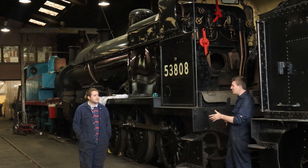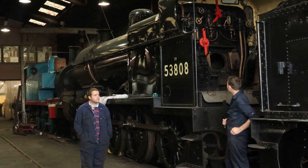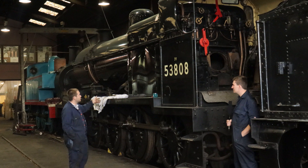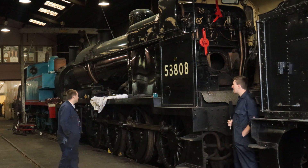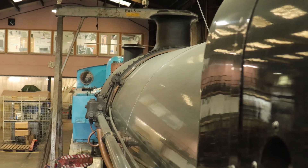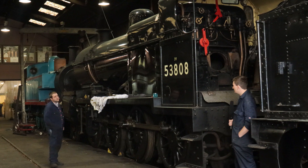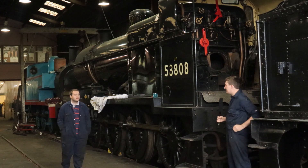In the first episode we looked at Canadian Pacific's boiler which is a Bulleid design. This one is very different — starting at the back and working our way forward, you've got the firebox where the fire bed is, which obviously boils the water as it's surrounded by it. Connected to that is the boiler barrel where the tubes sit. The gases flow down there, heat the water, and are expelled out the smoke box and chimney. Two different designs but the same basic thing happening on the inside.